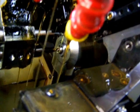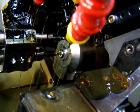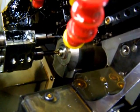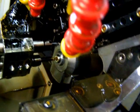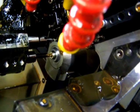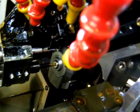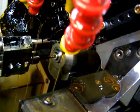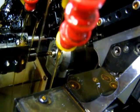Okay, here it comes. Let's go ahead and turn the oil well off just for a second so we can watch that happen. And I'm just taking a wee little bit at a time here. You can see the workpiece coming out, and we're enlarging that inner hole to something that's just a weird size that I don't have a drill for. And it'll come out then and put a little inside bevel on the part. And the outside bevel has already been taken care of. On that end there's an inside and outside bevel. Let's give a little bit of oil here just to throw away those chips. You can see the chips starting to form there on the counterboring tool.